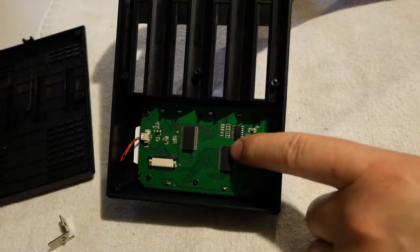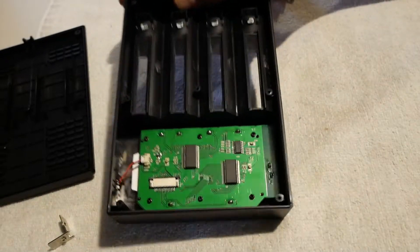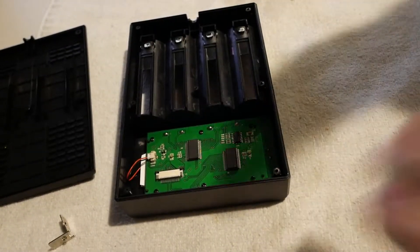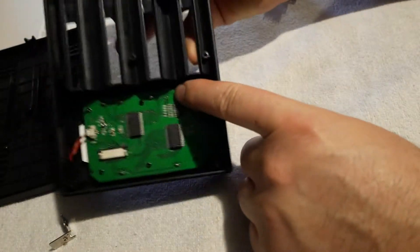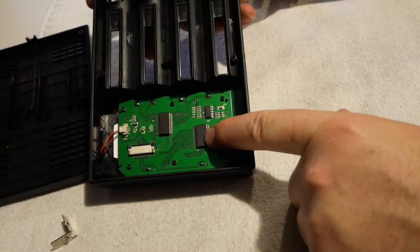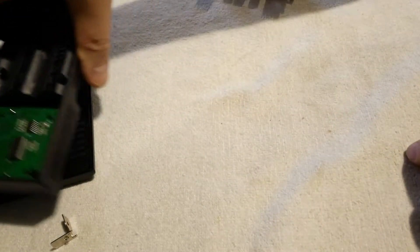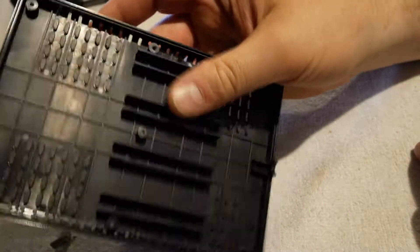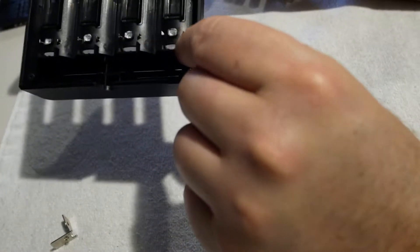It's probably got some TTL control logic and maybe a little bit more processing power. I don't really know because I can't tell you what the chip does. You've got the same layout as before — four capacitive touch buttons, and this little op-amp is reading all of those and converting those analog signals into digital signals, probably feeding them into this chip for digital control from capacitive touch. The bottom cover is pretty much the same as the Li500S, basic ABS plastic. The Li500S only has two temp sensors and now you have four.